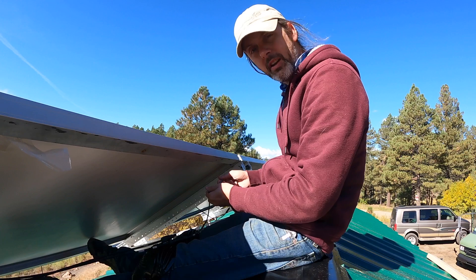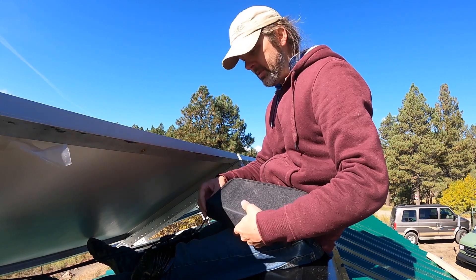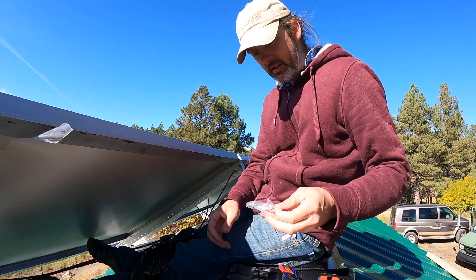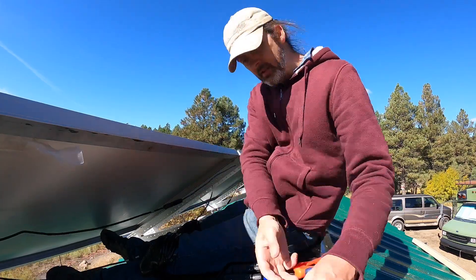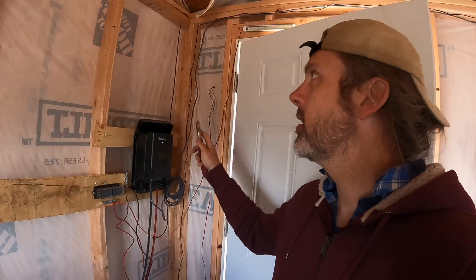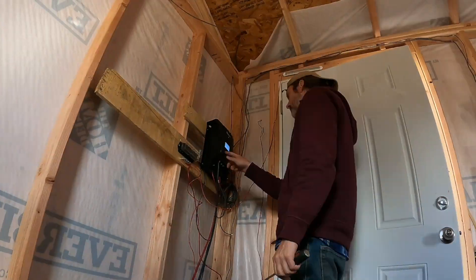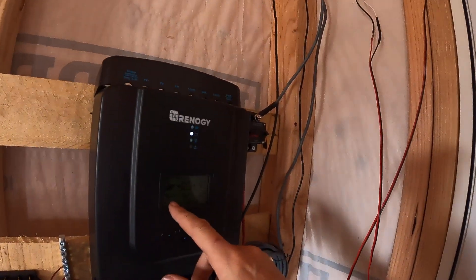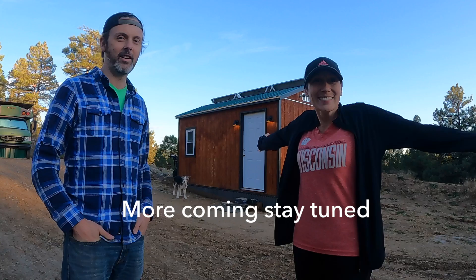Good morning — I need to hook up the solar panels. After a miscalculation on wire length, I found a local solar company that hooked me up with some PV wire. This is the MC4 connector kit I got off Amazon — they're all pretty much the same thing, you just crimp the pins on and assemble the MC4 connectors. Now I'm back inside installing a breaker between the panels and the charger, and then we'll see if it works. Moment of truth — boom, there we go, getting power! 365 watts, 76 volts. Solar system is up and running. Thanks for watching — stay tuned for the next one.